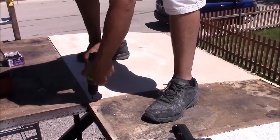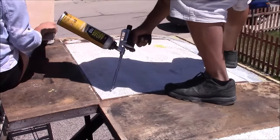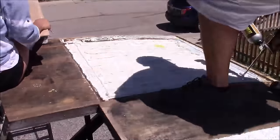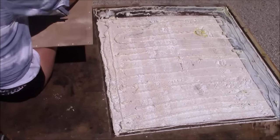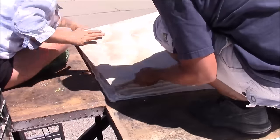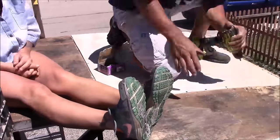I'm going to remove the four corner screws so I can apply the adhesive. I laid a bead about half inch wide every inch and a half — this stuff does expand but not nearly as much as the Great Stuff gap filler. You don't want to be cheap with this because you want good adhesion with that piece of wood. Now we want to quickly get that wood in place because this stuff sets pretty quick. The adhesion is so good it was stuck to my fingernails for almost a week, so you'd better wear gloves.